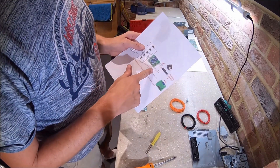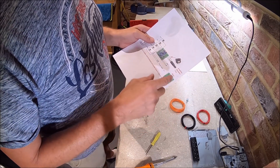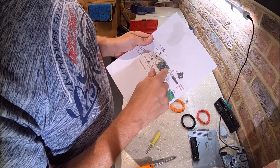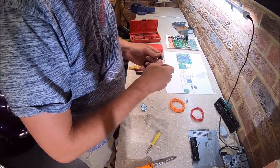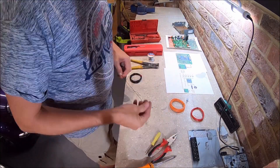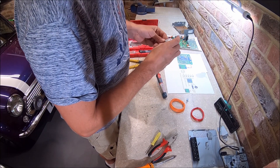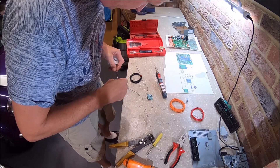So we've got some instructions here of how to do it. There are three output wires which need to be soldered to the board, there are power supply wires, and then there are switch wires. The first ones we're going to start with are the three wires that output the sound to the printed circuit board. All the wires will be too long to begin with and we'll cut them back as we need. Let's start with our negative first — it's the bottom left-hand side of the board. You need phenomenal eyesight for this, you really do.